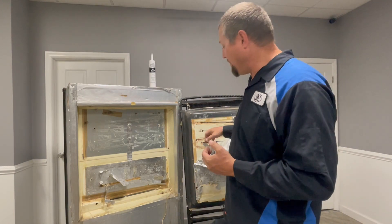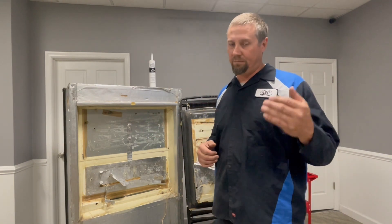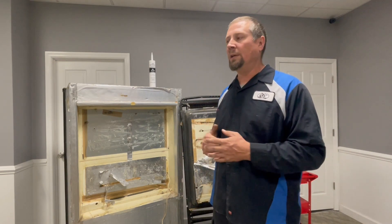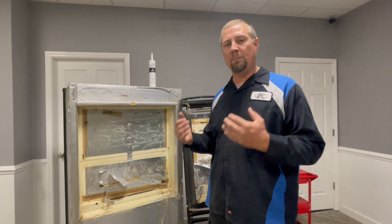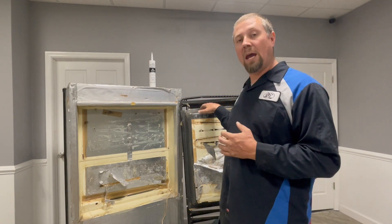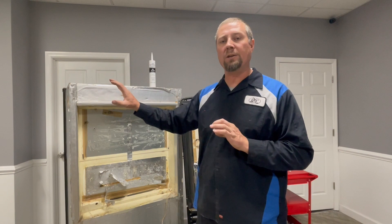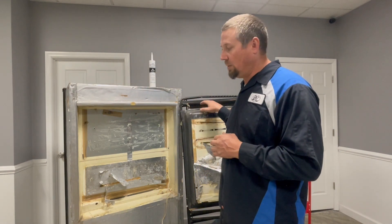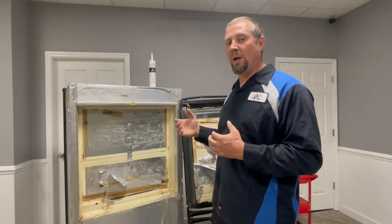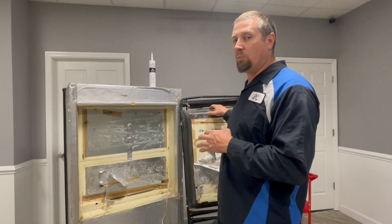That's problem number one — the one I have the most trouble with. People ask: how do you know if it's got the tinfoil on the cooling unit? Typically when someone says their 1350 is not cooling whatsoever, the first thing we need to do is run this refrigerator in bypass mode. Bypass mode is going to tell us what this cooling unit is actually capable of. We want it to run wide open, nonstop — take the controls completely out of the situation so we can see whether the cooling unit is plugged up, has lost its charge, or has a high pressure leak.